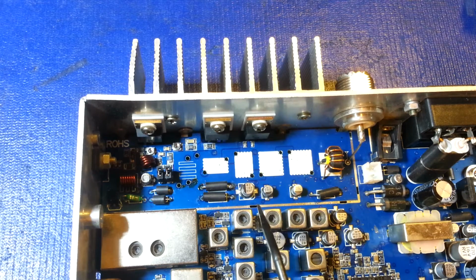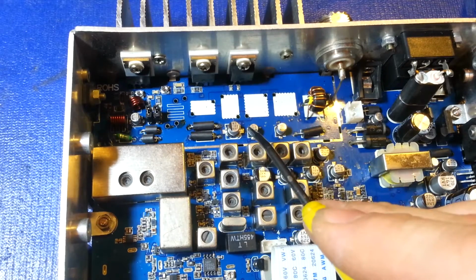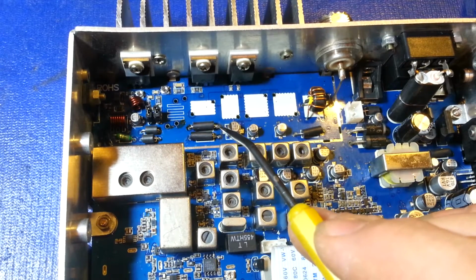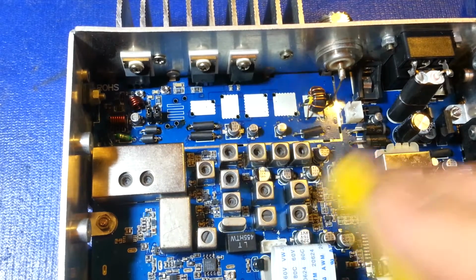And it looks like, being this is new manufacture, there's no doubt in my mind all of the solder that's currently on this board is lead free. The problem is it looks like someone tried to, or used lead-free solder to do their reflowing.